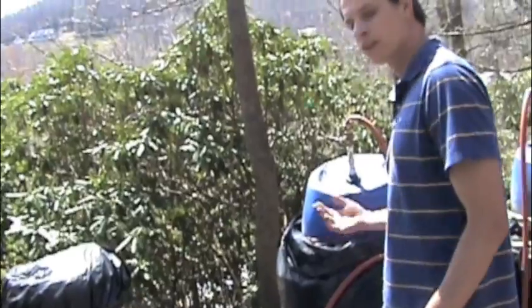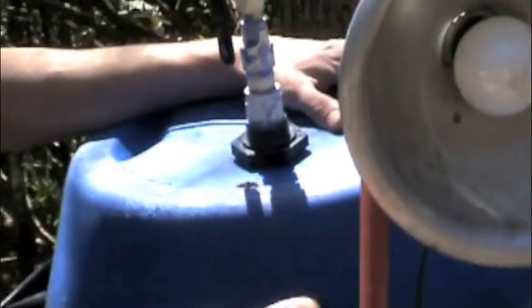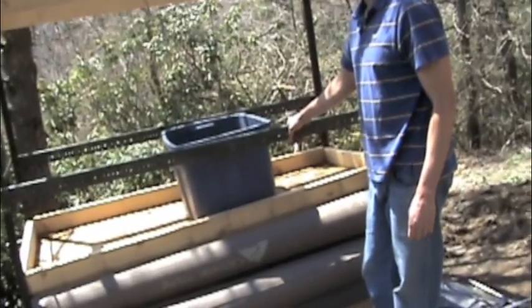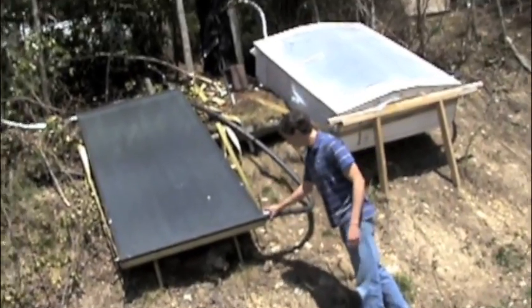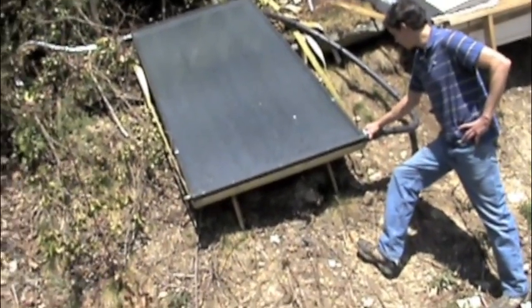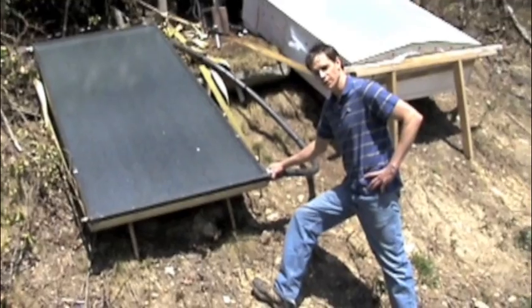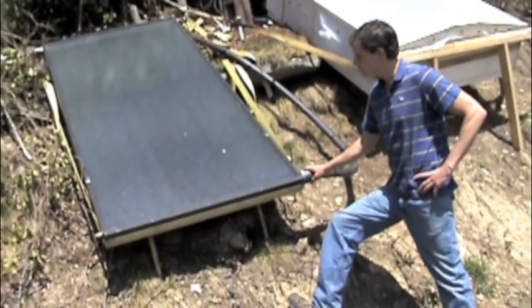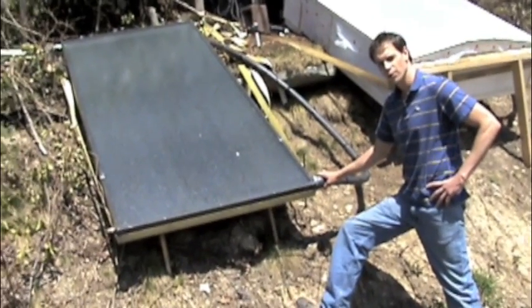After taking my recording, I cut this valve and press down so the gas flows out into these air mattresses over to my right, which you can see are nearly full. When I fill one up it gives me about six inches of water column — exactly what I need to create proper pressure for burning. What I have here is a 4x8 solar thermal flat plate collector. Its performance has been excellent and very close to that of a pump system. This panel is located lower than my bioreactor, which enables thermosiphoning, where hot water rises up and through a heat exchanger within the bioreactor for heating.